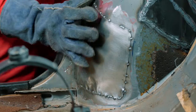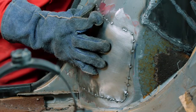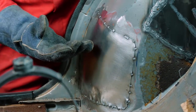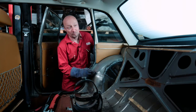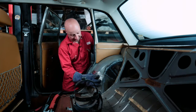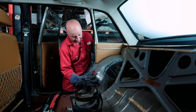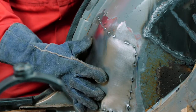What we're going to do now is do a series of short runs. I don't want to put too much heat into this, and when you're starting to weld you shouldn't get too ambitious and start running really long welds because inevitably you'll probably blow a hole. We've got good solid steel here, but I still suggest short runs — you don't build up too much heat. In some cases you can put some distortion in if you start to put too much heat in.